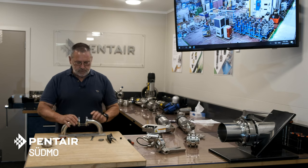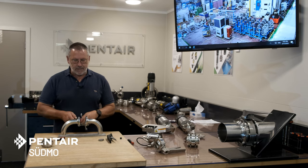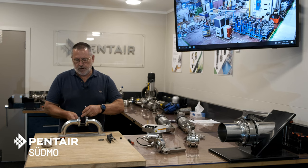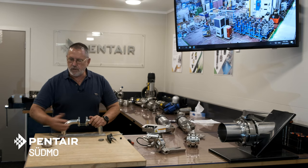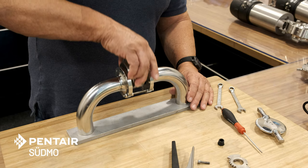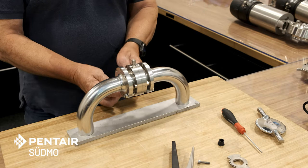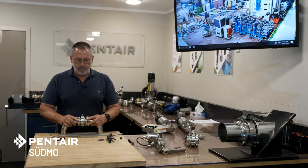The big advantage of the jacking bolts is that they stay in place and the pipework doesn't spring off in different directions. Realigning the valve back into place after service is simply a matter of dropping it back in the cradle and setting it on those cradle bolts. Then slack off the jacking nuts, tighten the clamping nuts back up, and you're back in service.